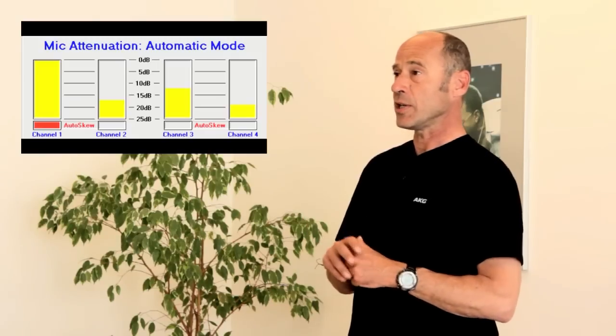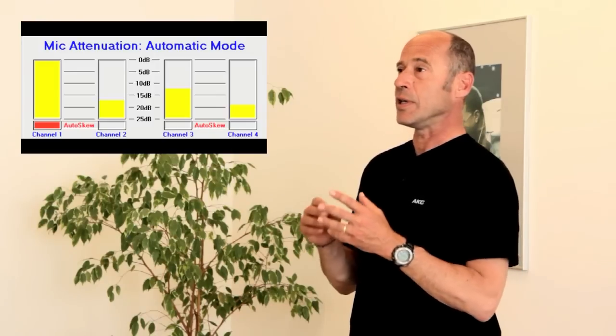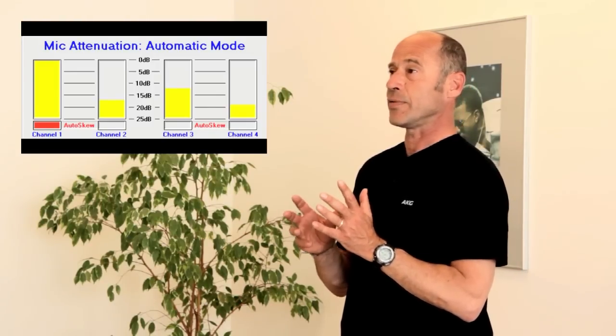The DMMs are using a sophisticated algorithm to determine if the signal is relevant or not, regardless of the level of it. The way of mixing is called Gainsharing. That means that the output level always stays constant. All input channels added together share 100% of the output level you adjust on the main out, all the time. If no relevant signal is recognized, all inputs are reduced by a certain level to reach the 100% level again. If one channel receives a relevant input signal, that input gains more gain. The others are reduced even more, so that in total we still have that 100%.